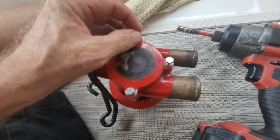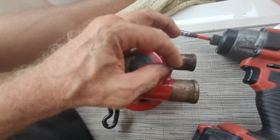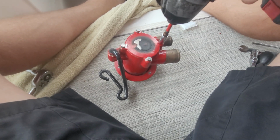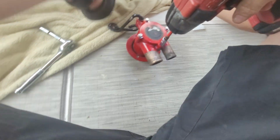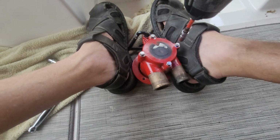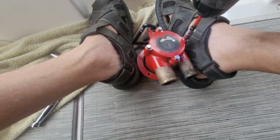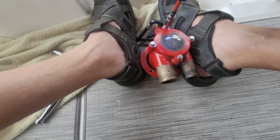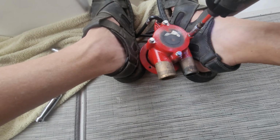And boat mechanics, like a walrus, they like a nice tight seal. Okay, there's no specific torque rating required for these. Just make sure you're using good practice and just kind of snug it first. Let's see if I can do this with one hand. Snug it first all the way around. And once it's snugged, then go back and forth. And I'll just do it one more time.